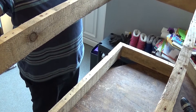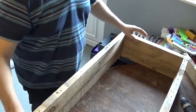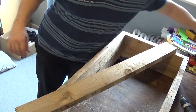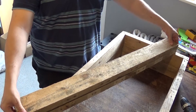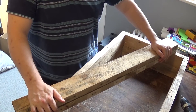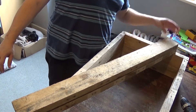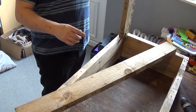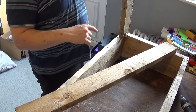So this isn't far off from being square. The next job is to make the pieces of wood in between here, which will then make the entire frame level. What we need to do is take the last two pieces of wood and cut them directly in half — as my wonderful wife suggested right at the beginning. If we hadn't done it her way, we wouldn't have had enough wood. So we're going to cut these directly in half and connect them in the corners, then the top can go on after we've laid the planks.